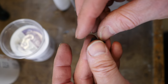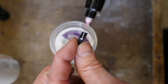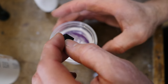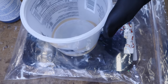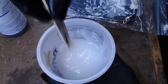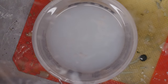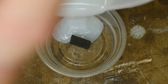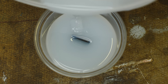Where you saw me doing the cleanup at the beginning of the video, this is where that little rubber stopper lives. We're going to make a mold for this, and I'm going to make an open face mold — probably the first time ever on YouTube. I'm not a big fan of open face molds; obviously you can't control that last surface, but in this case it's just a little stopper that goes on that little flexible clip, probably prevents it from rubbing against something or keeping it quiet.